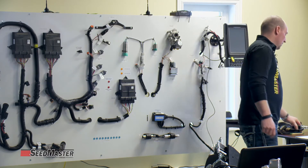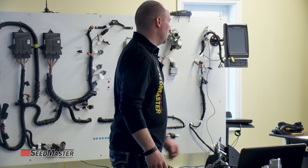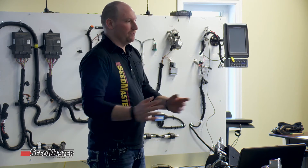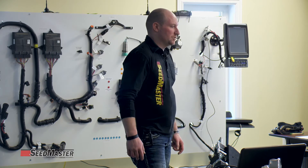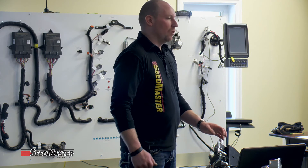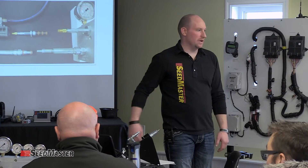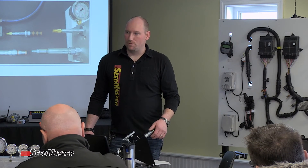When it's flowing, it's then using the PWM, which is going around there. It has power to that solenoid that's activated on it to adjust that PWM for where it's going to be open and close. Remember, it started from zero, which is full open, to 253, which is full closed. When it's closed, it has the highest pressure it can achieve. The PWM also has an actual manual override — the same as the relief valve that went around — where you loosen the jam nut and physically turn it in or out to manually adjust it. That's another way to physically manually check it without fully removing that valve.